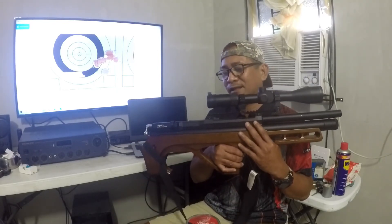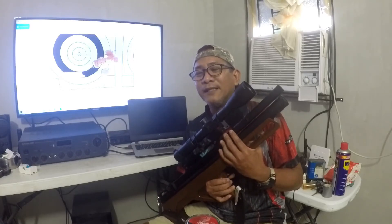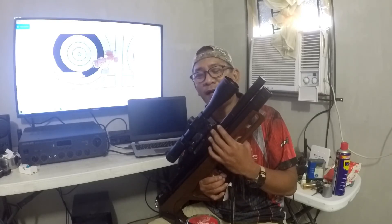Always remember it is not just the shooter — it's also the equipment. If both the equipment and shooter are good, that's the best combination. You can buy a Lothar barrel, which is accurate, but if it's not properly crowned or the breech isn't done well, it's just a waste of money.